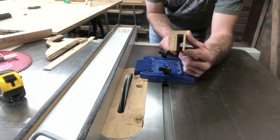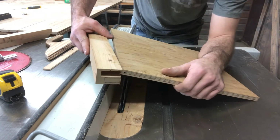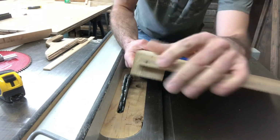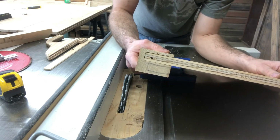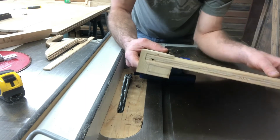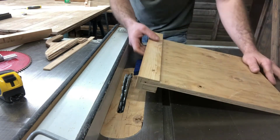We've created our dado cut now. Let's just test it out on the 1/2 inch plywood. And we got a nice perfect fit. Okay, so this is important to just test it out. Make sure that your blade's set up. If it doesn't fit or you gotta force it, stop, adjust your blade, go ahead, run through, make sure that it's good. If you got her the first go, right on, and go ahead and run the second stop block through.